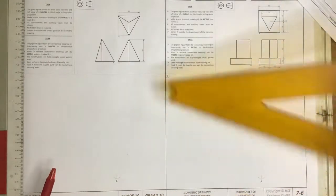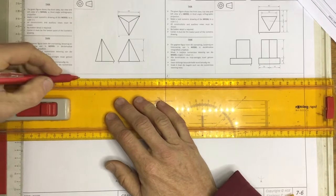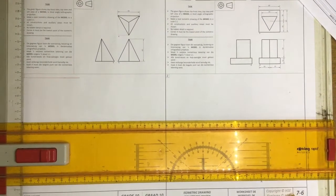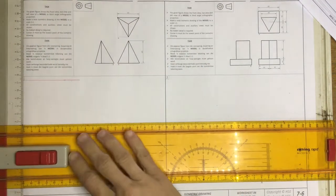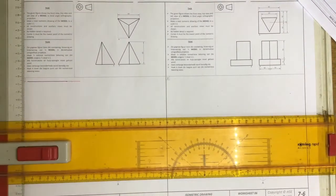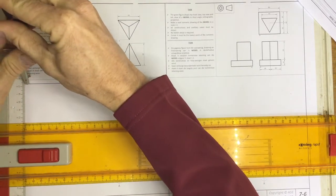To start with, you've basically got this little blank page over here and we need to create an auxiliary view to start with. I'm going to draw a construction line over here and I'm going to measure off on that construction line the length that they ask us to use, which is 60 millimeters. I measure off 60 millimeters and I mark that off. This can be done as a construction line — if you don't want to have an auxiliary view on your drawing — but for most exam purposes, they insist on seeing the auxiliary view.